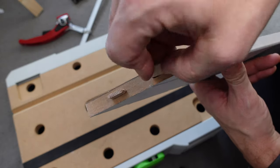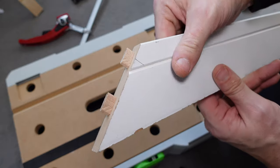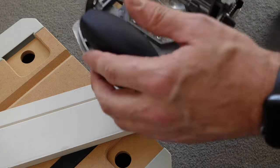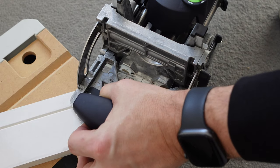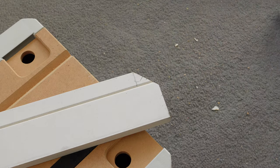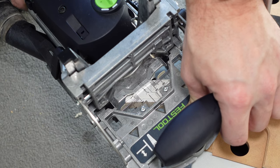In terms of positioning, one is done using the little tabs on the machine, and the other I've actually marked 80mm from the corner of the mitre. On the smaller piece I've marked it 15mm from the inside of the corner. To give some flexibility I'm using the slightly looser setting for the slots on the vertical pieces.